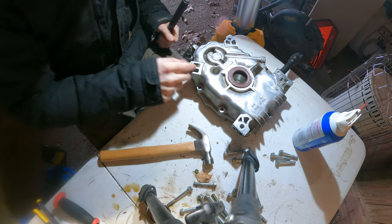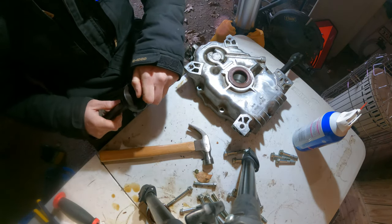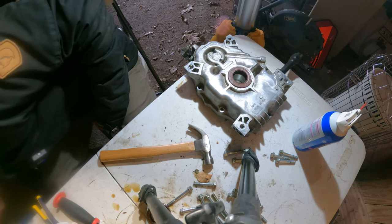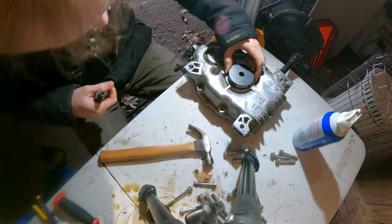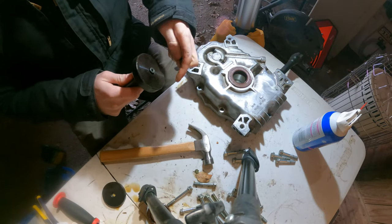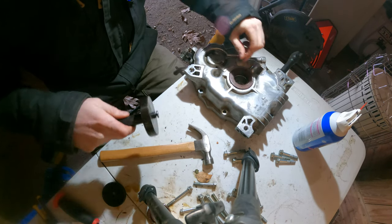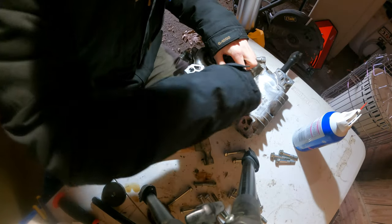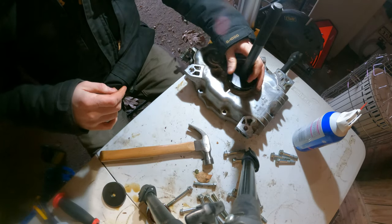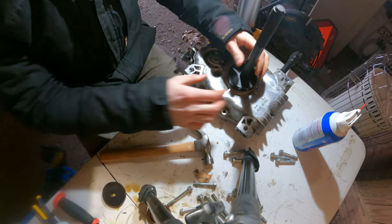It started to go in on one side a little more than the other, so I'm going to switch to a bigger driver to make sure I cover the full outside diameter of that seal. I'm going to go with a 65 — actually, let's go with the big boy, the 74 millimeter, until we go flush, and then we'll switch to something smaller. I'm hitting evenly on the outside surface all the way around, and that's working better — it's going in more even now.